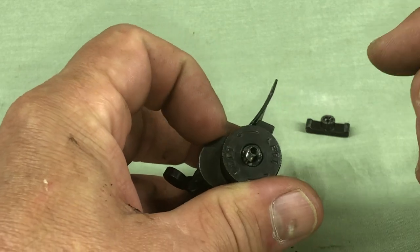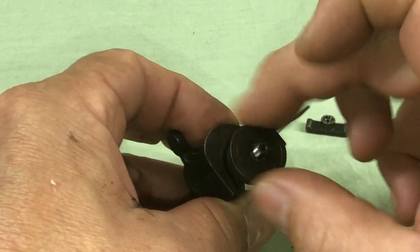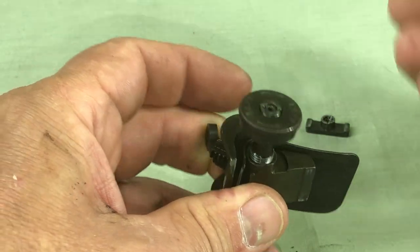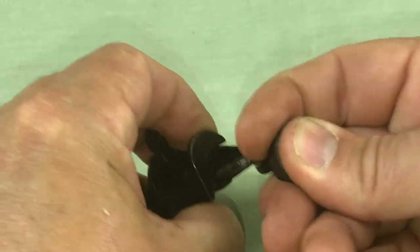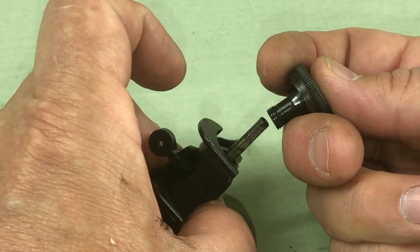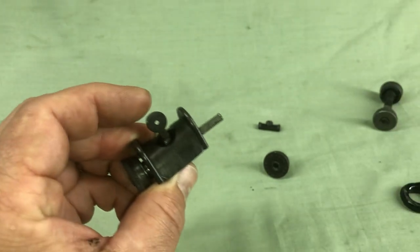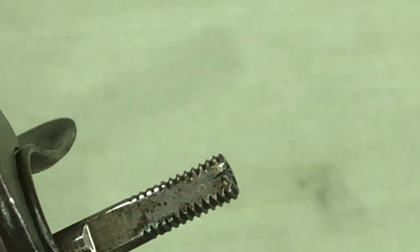This bushing in here has a little D on it and can also get stuck sometimes. Don't forget that the windage knob is screwed into the base — you have to unscrew it first. It's stuck to the base right now. Once you're clear of the base, grab it, put your thumb over the spring area and the bushing, and yank on it. You might get more torque on the backside once you've unscrewed it, or try putting a taped screwdriver in there and pulling it off — but make sure it's unscrewed from the base first.